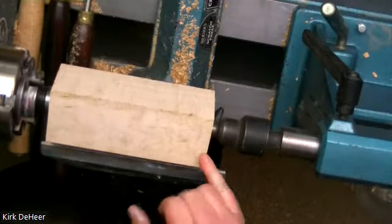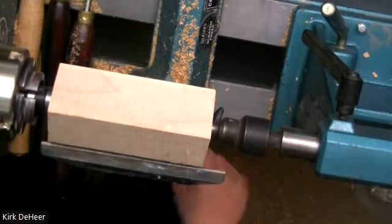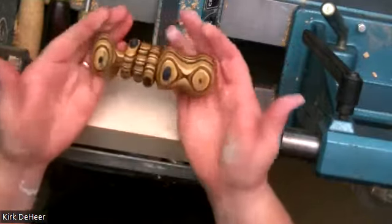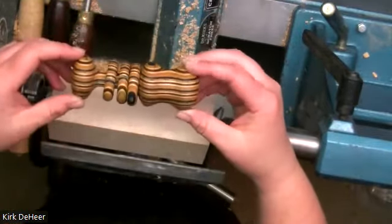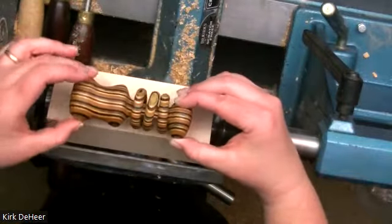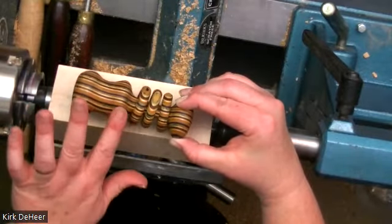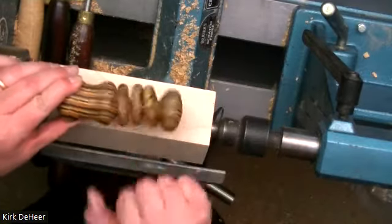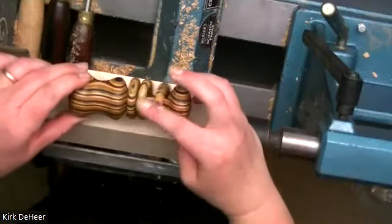We're going to use this — it's about two and a quarter by six and a half inches, that's the general measurement we go for. Let me show you a rattle. This is about what we're aiming for — this happens to be a skateboard rattle I made a little bit ago. We're going to do the handle — which is a big bead, cove, big bead — and the head is just a big bead. There's a trick to cutting captive rings and I'm going to show you, because this is literally what got me turning in the first place.